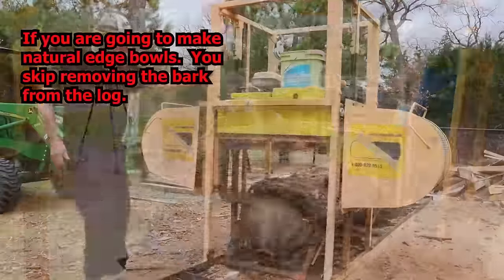It's a little tough sometimes to see where the hole is in your blank. So one of the tricks I use is I'll use some bright chalk, and then when you look under there, you can see where the hole is better to get it on the hole. And there it went. Now, if I start turning like this, I'm going to push this. First thing I'm going to do is not turn this and go straight in till I bottom out. There's a stop right here. Once it bottoms out, then I'll start turning it.